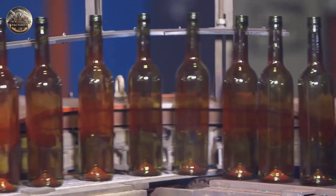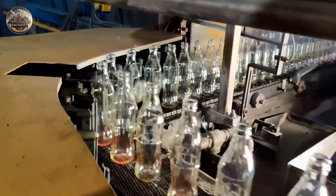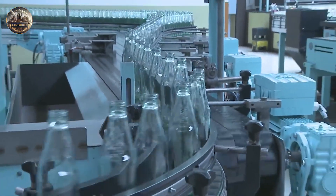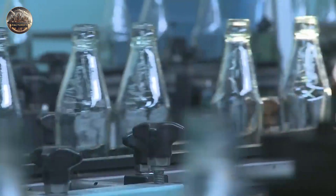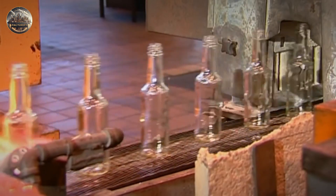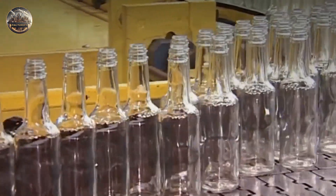Usually there are two surface coatings applied to glass bottles and glass jars. The first one is done before annealing at the hot end, and the other happens at the cold end, right after annealing. The coating gives the glass a virtually scratch-resistant surface. As a result of reducing surface damage during use, coatings are often described as hardening, or strength-retaining, coatings.